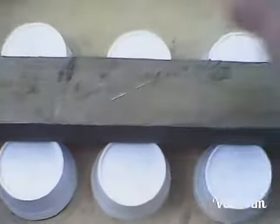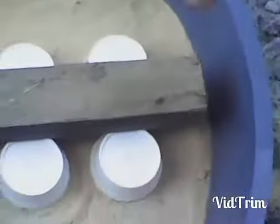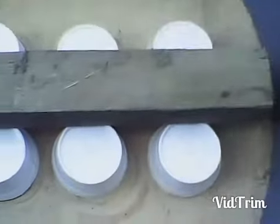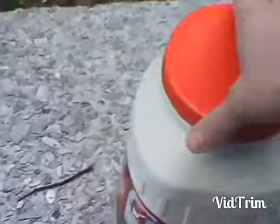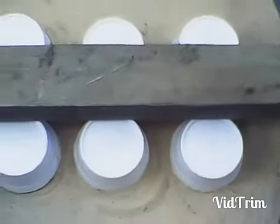So, I cut the cups, now the idea is, I'll have this on top. That's pretty much there to hold down the cups right now, because it's styrofoam and it's a little bit windy outside. I'm gonna fill around it with this loose sand to hold them in place, and then around the actual one by one piece of wood, I'm gonna pack it in with my green sand to keep a form, so when I pour it in there, that's where it goes and stays, and it doesn't just push the sand out of the way and hit the side.